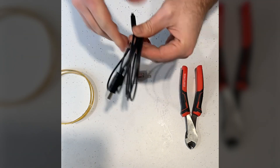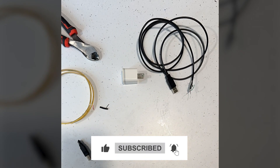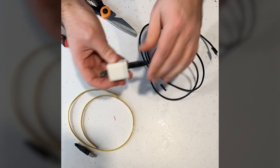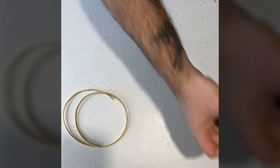While that dries I can get started on the electrical. Since the LEDs I'm using run on five volts, I can cut up and reuse an old USB cable I don't need anymore, giving it a glorious new purpose. Most USBs have a few different connections, so make sure you use the red and black wires in the respective terminals and disregard any others.